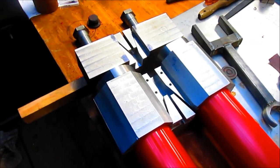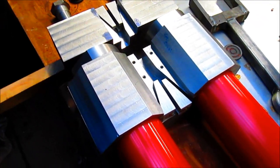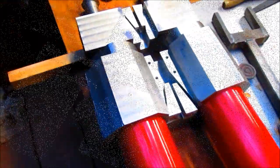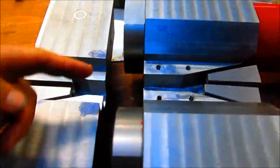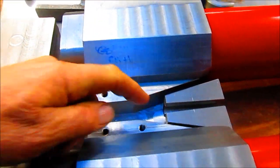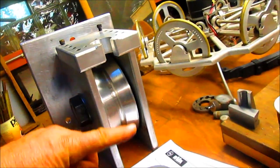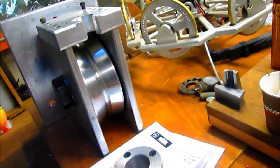After all of the cutting, milling, and lathe work, we're down to this whole thing starting to take shape. These are the two rams — they go into those holes that we bored out. The cable goes through here, and these little sliders are grippers. The cable comes up here, goes through here too, and then goes over into the pulley mechanism that transfers the energy sideways.